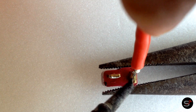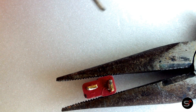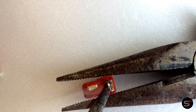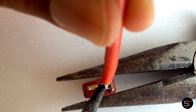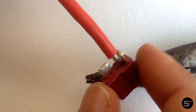Soldering the Deans is also quite simple. Just apply some solder on the exposed side. Get the wire in contact and hold it until the solder turns to a shiny silver metal form. You're done — just cover the exposed part with the shrink tube and shrink it.